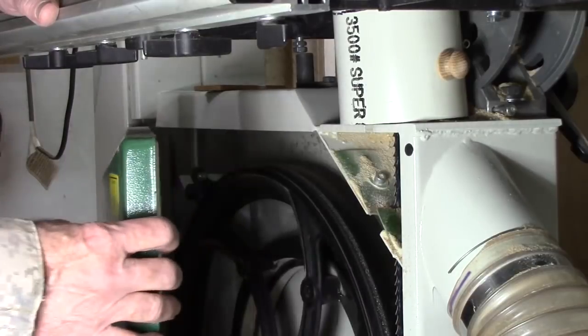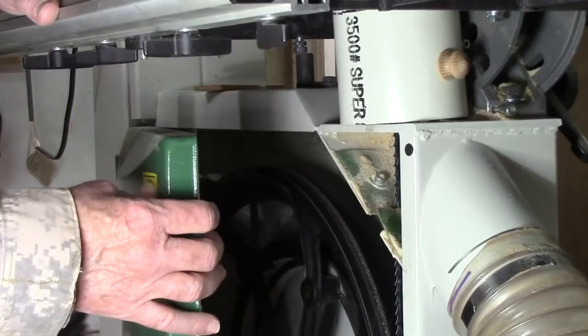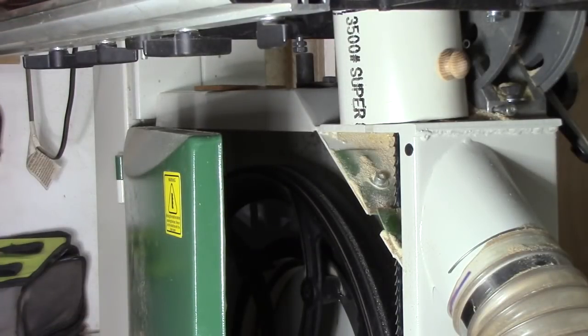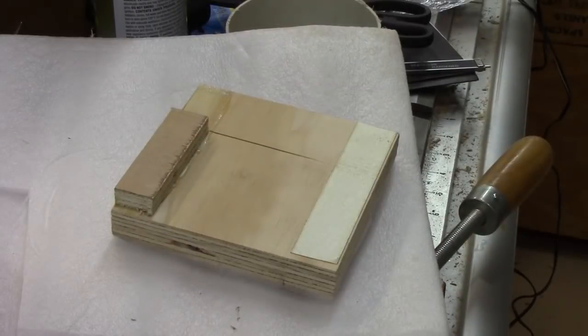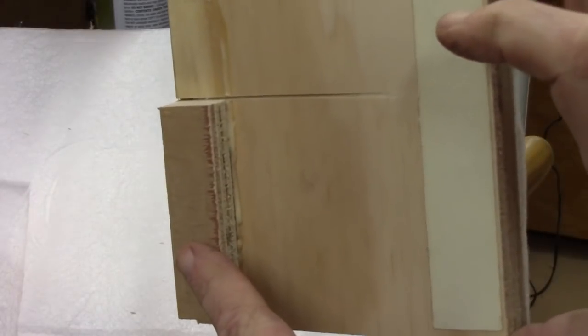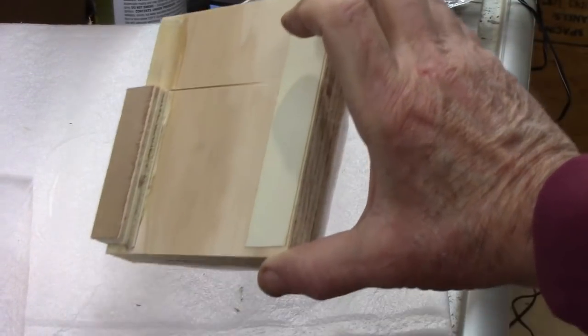On Kevin's bandsaw his door was flat metal, which made it a little easier — you can see from his photograph just putting in some flat wood with foam rubber. Because mine is curved, mine tended to be a bit more complicated. Because of the profile of the metal door being rounded, I had to cut this away so it would stand off on one end and I've got clearance for the rounded metal on the door.